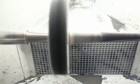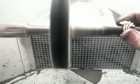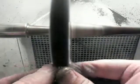First you're going to polish the inside of the ring, doing one side, removing the ring, flipping it over, and doing the other side. That way you've got a good even polish on the inside. When you're polishing the outside of the ring, just be careful not to run the wheel parallel with where you cut the ring. It'll pull the solder out, creating a visible sizing seam.